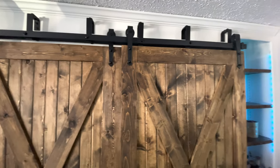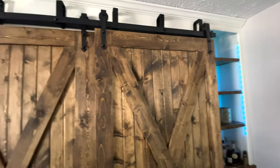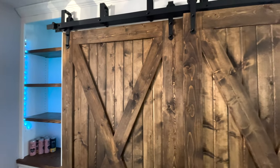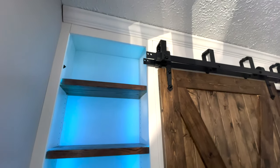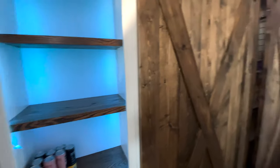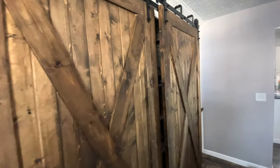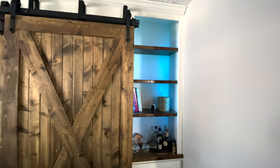So in this video, I'm going to talk about what we built in our pantry and how we installed these Hue light strips — how I not only extended them, putting a large extension in between two areas that are not lit and what we used to do that (the Cat cable), and then how we split the light strip. I took one main controller and split it into two light strips to control two completely separate parts at the same time. I felt like there wasn't a lot of information out there, so that's what we're going to talk about.